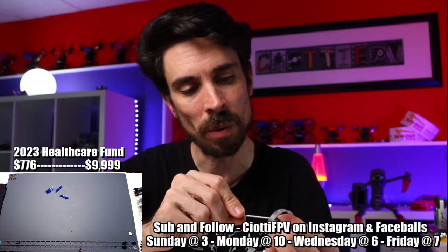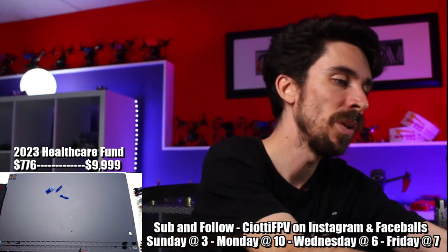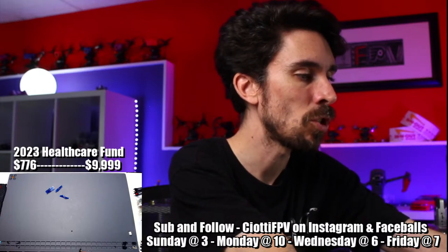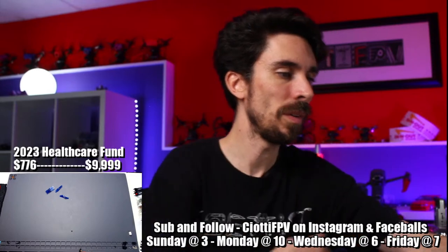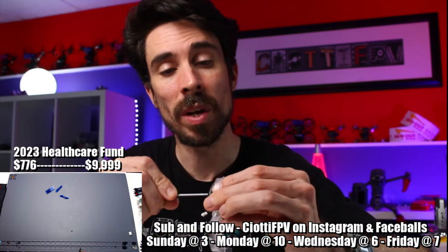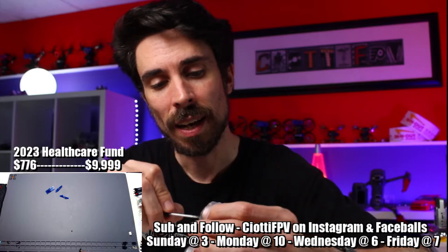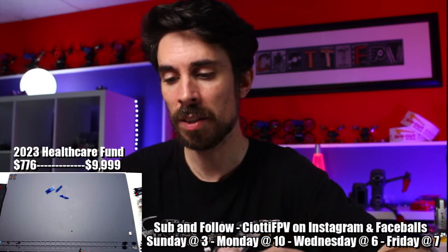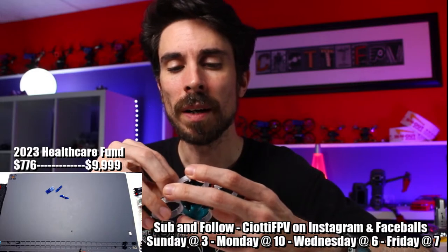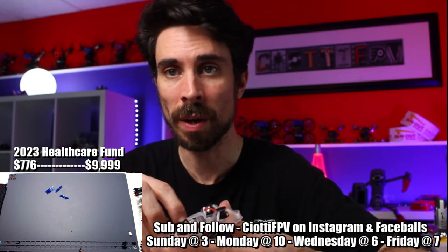I do not have an extra PH 2.0 battery. I do have two PH 2.0 250 mAh batteries, but I really want to run this thing on a 300. So let me turn this charger all the way up over here, and I'm going to put one more 300 mAh battery on there, and hopefully it'll have enough charge in it by the time I'm done screwing these motors down that we can run it on a proper 300 mAh battery. The 250 mAh batteries are great because they're lighter, but they're significantly more saggy. And to me, the weight savings does not offset the sag. It flies better on the 300 mAh batteries. But I don't know why I said but. I don't have anything to say after the word but now.